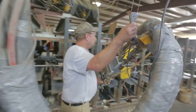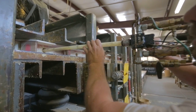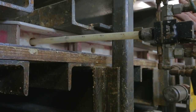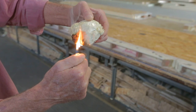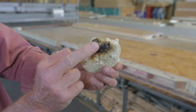The polyurethane is a two-part mixture that we inject into the panels — so it's not a block foam. It's actually injected and it sets up inside the panel. Our foam is a class one fire rating, which means you virtually cannot burn one of these panels. They keep their structural integrity until they're completely consumed.